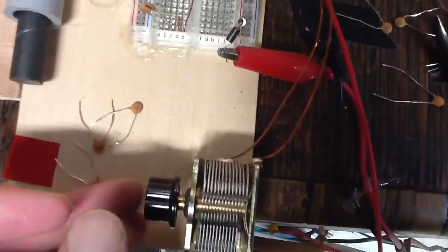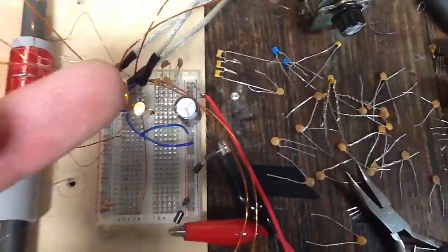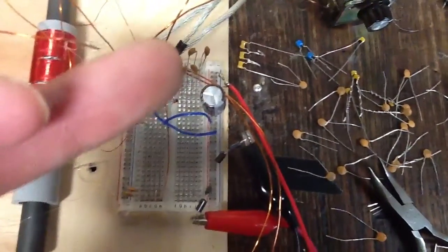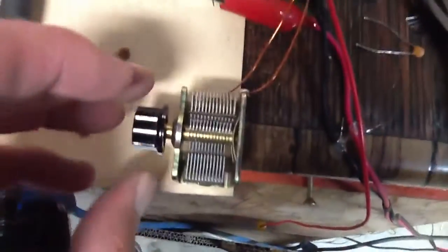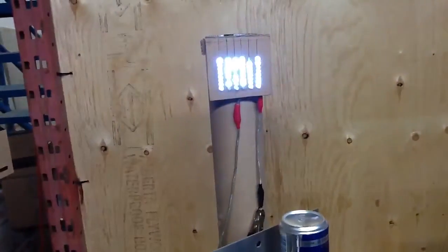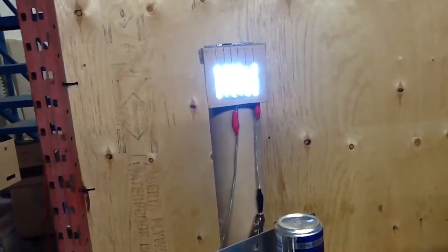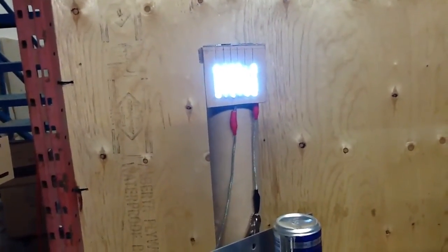Once I switched to the smaller top load, I found I was just at the limit of the capacitor here, so I added a fourth 100 picofarad capacitor in parallel to the feedback circuit. Just when I rotated it to the very end of the dial, this fundamental harmonic came into range. And then I realized the whole time I was tuning on one of the weaker harmonics, trying to squeeze everything I could out of it.